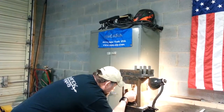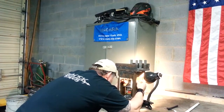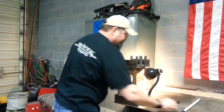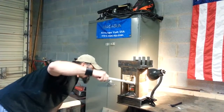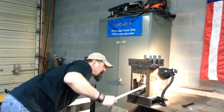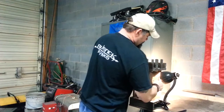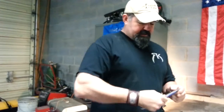I line that back up underneath the stamp. I grab my blank with the reference lines, put it under the stamp, and line everything up. Looks good. Then I press the knife blank up into the stamp. I can see daylight from the bottom corner of the stamp to the blank. As my RK is getting pressed in, that daylight disappears, and when it's gone I know I've reached the proper depth. Push down the knife, and then I have a perfect RK stamped into my blade.